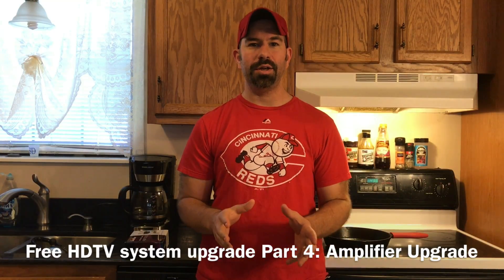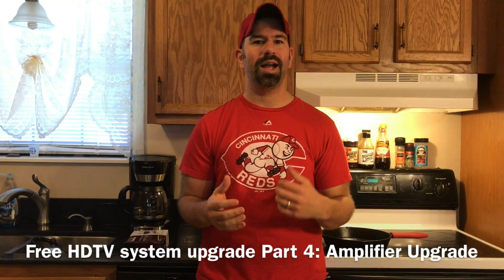When I built it last year — and it's been exactly a year now — I kind of cheaped out on one element of it. I bought an outdoor amplifier, and it's outside, and I ran into a couple problems with it. Here it does get down below freezing, and anytime it got below 32 degrees Fahrenheit, I would start losing signal. And then this summer, as it got hot, the hotter it got, I started losing signal again. Those two things combined, now that amplifier is going out on me.